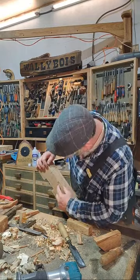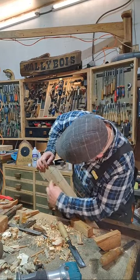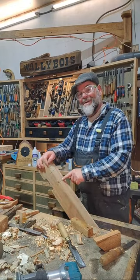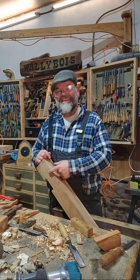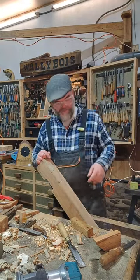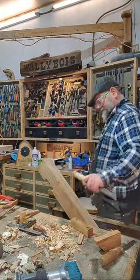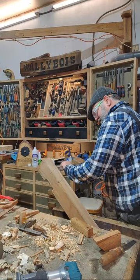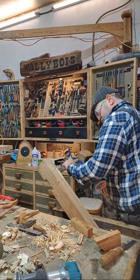That one has gone, looks like it's gone astray on both sides of the same line, the same distance. These lines on top there, the faces are correct, but I hadn't lined them up properly because there's an arris that's taken off there and I've got a lump out there. So I haven't actually eyeballed it properly. So you can all make mistakes, but it doesn't matter. So keep telling yourself that happens. People watch you get it wrong. Oh, crikey. They watch you.